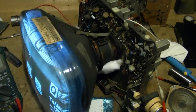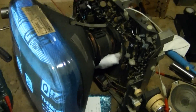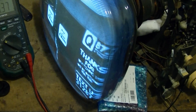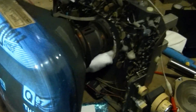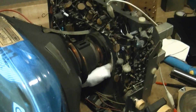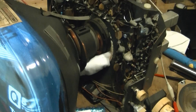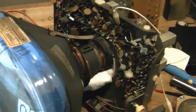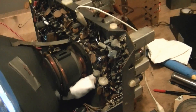I've been doing a little more work on this Motorola 14P3 set, and I have yet to find a smoking gun as to why the reception just isn't that hot. I've checked all the resistors and really they've all been within 10% - I was quite surprised. I replaced a few because they were kind of right at 10%, but really I think I could have left all the originals in there and would have been fine.